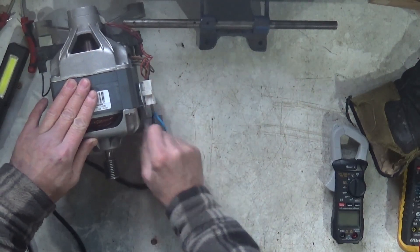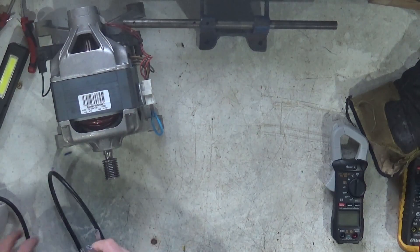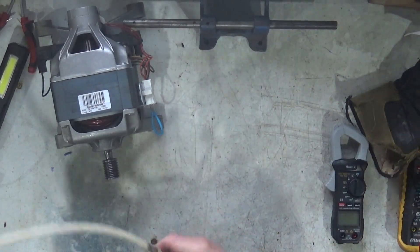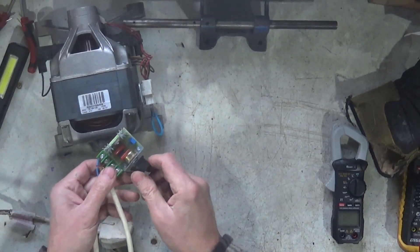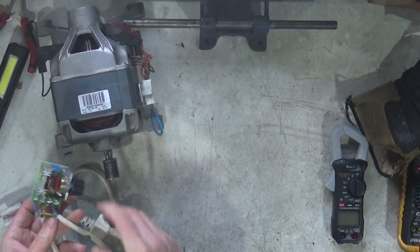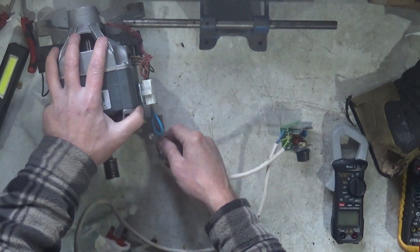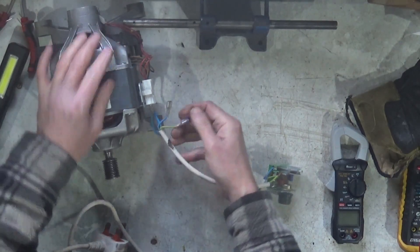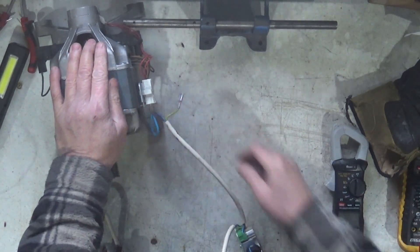What I've done is I went off and looked up circuit diagrams from motor controllers — straightforward basic ones — found a few. But in my search for components, what I found was you can buy — for a tenner you can buy five of these from Amazon, I'll put a link below. What that is is a standard triac. I've wired that up across there so that we can connect this to the motor.